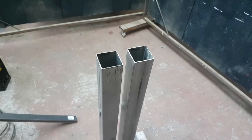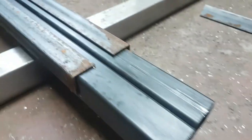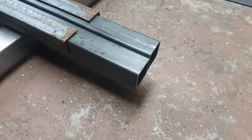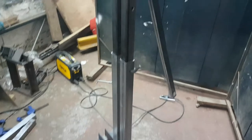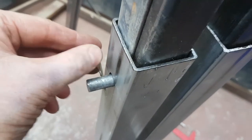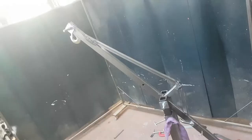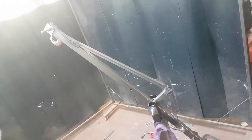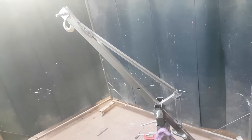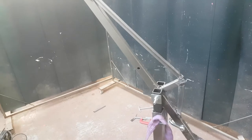I've cut off the upstands and now I've got two pieces. I couldn't get a good fit on these so I've added some angle to make them tight, but this will make an extending vertical section so I can adjust the height of the pivot point. For the extending section I've made up a pin just with a bent piece of bar and drilled it so I can put pins through. I have the highest setting and one lower setting. I've also added a triangular section over the top which has stiffened it up quite a bit — it means it doesn't want to bend at all and would probably take well over 200 kilos now, but very stiff at the intended 100 to 150 kilos.